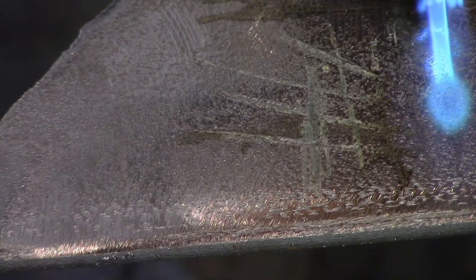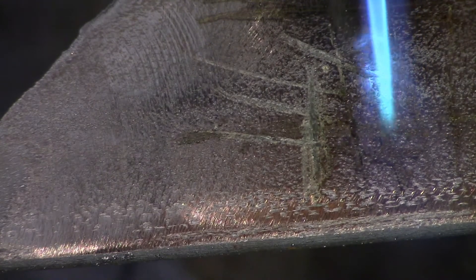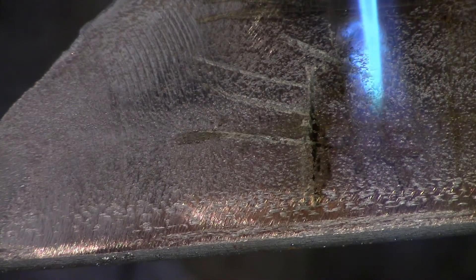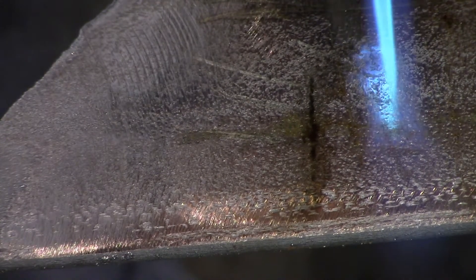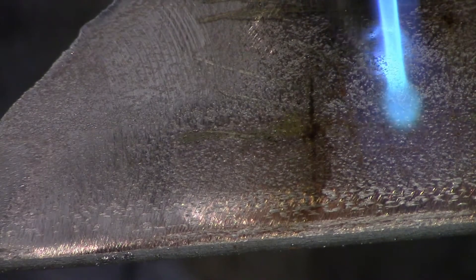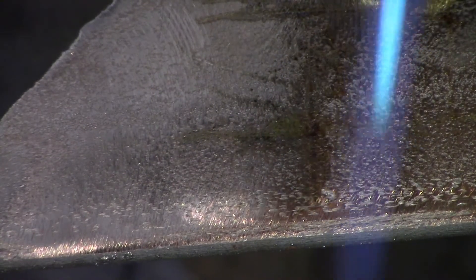That's how you know you're at that 250-degree mark right there. These are useful when you need to preheat — a lot of times on thicker steels you need to preheat to 250 or 300 degrees, and this is one of the acceptable methods of determining you are at that predetermined heat. Hope this was useful. If you liked it, hit the like button, or leave a comment explaining what you didn't understand. Thanks for watching — subscribe if you're interested in metal, welding, engineering, or related topics.